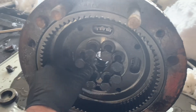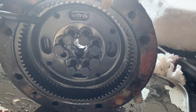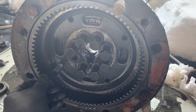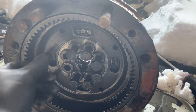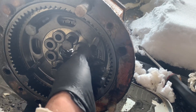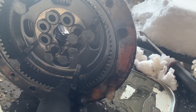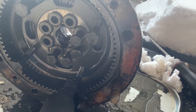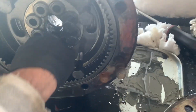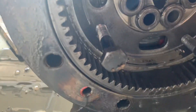Once you get it apart, you'll remove these eight bolts. Now to pull off this ring gear — this is what holds your hub in place and keeps the tension on your bearings — you'll take your bolts and screw four bolts into these holes here, and when you thread those in it's going to pull that ring gear off. The first time I went to remove one of these it was at night and the other side was full of sludge. I couldn't even see these holes, and it had been a while since I'd had one apart, so I wanted to provide this video for anyone stuck in the same situation.